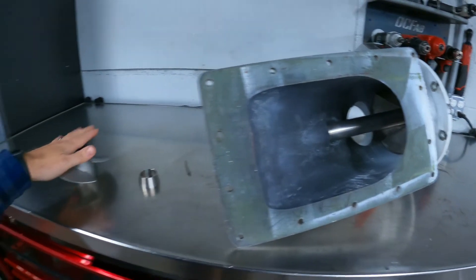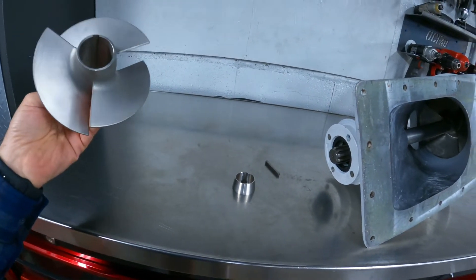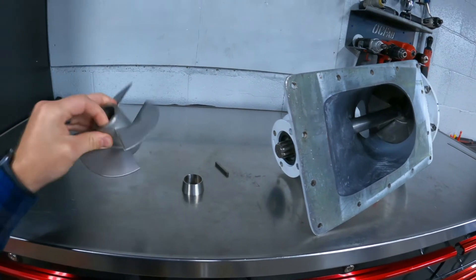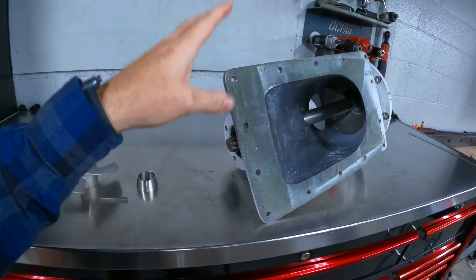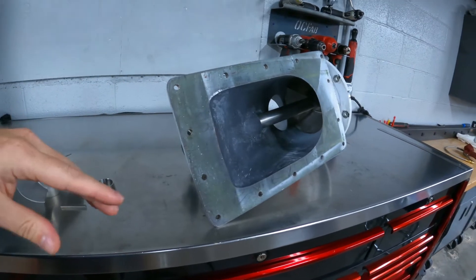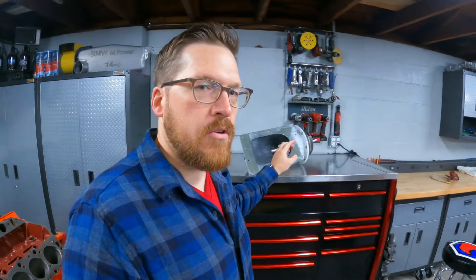I don't have to rely on the speed of the boat to pressurize the suction housing to actually get going, so it'll pick up quite a bit quicker. These are pretty simple to get on except you need to have the shaft machined - you need to turn it down and also cut it for the keyway. So what I need to do is get this shaft out of the pump, send it out to get it machined, and once it's done I'll get that all back together and installed.